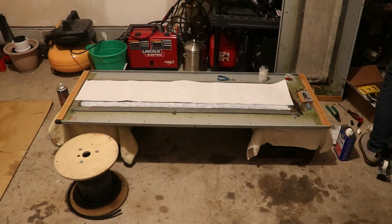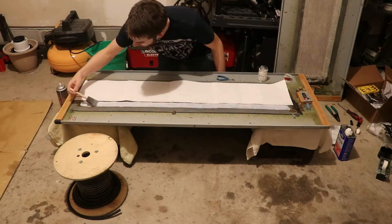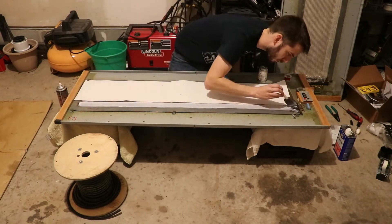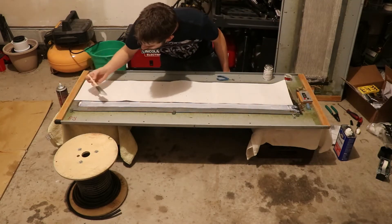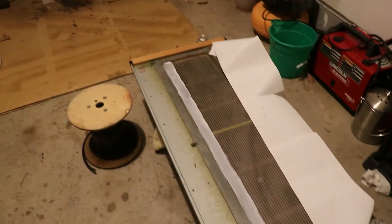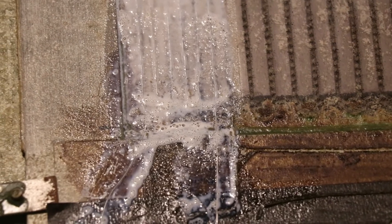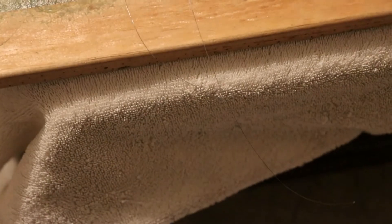Next I'm putting on the first layer of 30NF, which MagnaPan supplies. This is the true adhesive that gets it on the diaphragm. Once you apply that first layer with the included brush, you can take a foam brush and finish it off. You can see the treble wire is down and the first layer of 30NF has been applied. I've also left myself plenty of wire so I can attach these to the new solder terminals when it comes time for that.